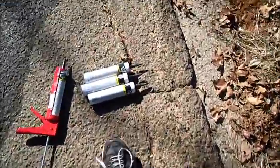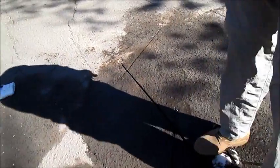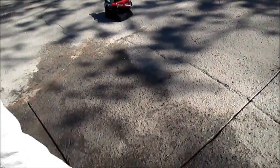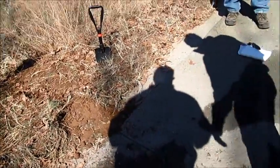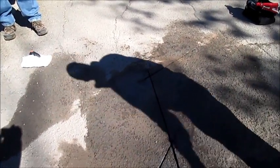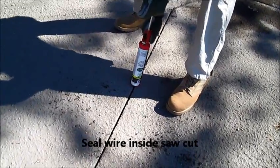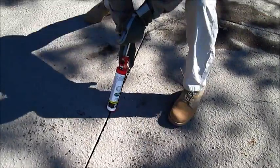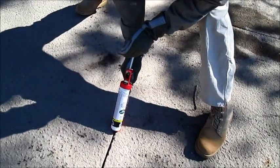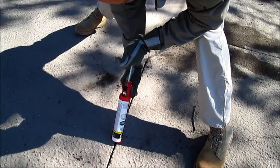The sealant we have is really just ordinary asphalt sealer — it is not the ideal thing; probably an epoxy kind of sealant would be better. But we were able to get this at the local hardware store and do this job in one day, so it will work fine. It might only last a few years before you have to reseal it. At this point we are filling the slots with asphalt sealant. Try to create a waterproof seal, because loops most often fail when water gets inside and then freezes.